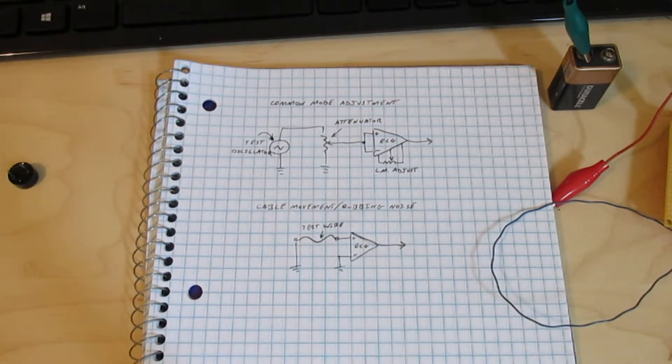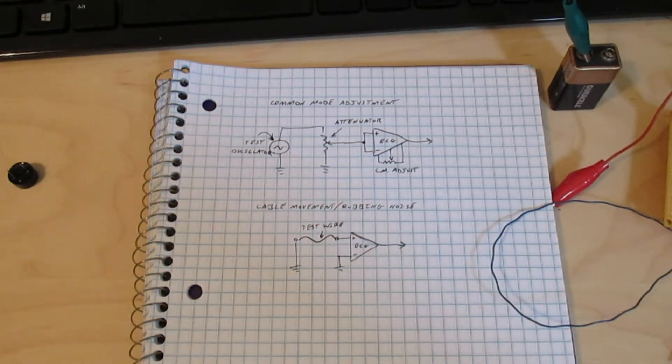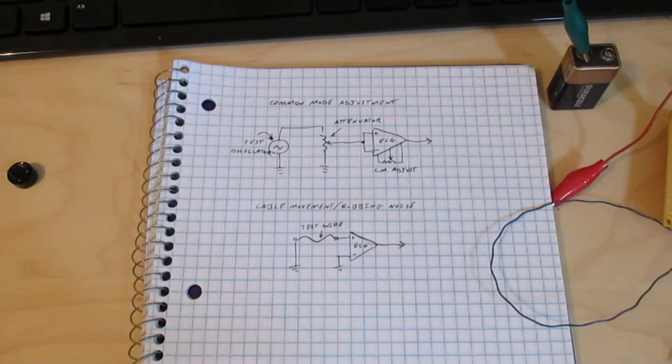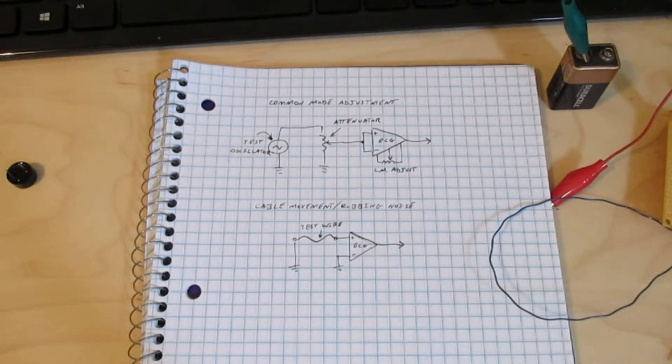When people would wire-wrap audio circuits, the sound coming out of the speaker would end up vibrating the circuit board, vibrating the wires, and then generating more voltages inside the circuit and messing up all sorts of things. In particular, I found one type of insulation material — polyvinylidene fluoride, or PVDF — which is used a lot in wire wrapping and has a pretty strong piezoelectric effect. So maybe my wires are made out of that, or something similar that has a piezoelectric effect.